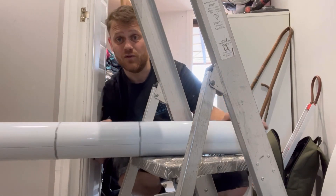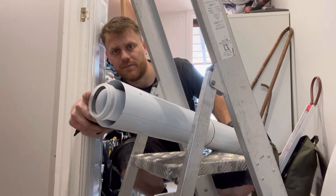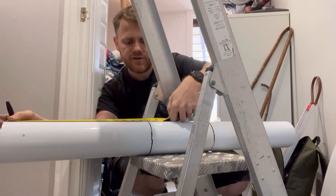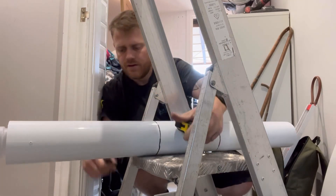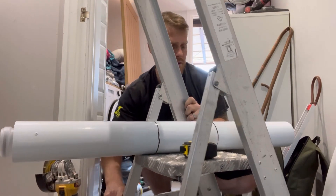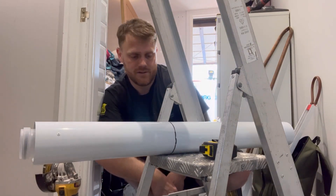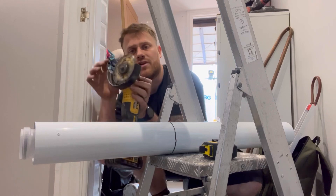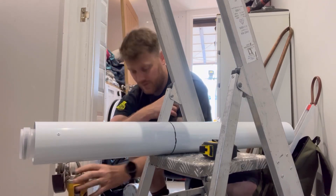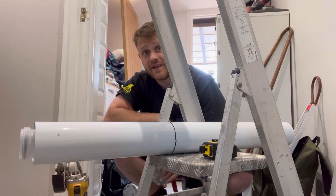I've got two lines so I nearly cut the wrong one again. You want to measure from the end — it's got that lip on. So from there to there it's 317. I've got an angle grinder now — when I was an apprentice all we had was a hacksaw. This saves so much time. That's the DeWalt Extreme metal blade, really good, worth its weight in gold. Paid a little bit more than the normal ones but it rips through it. So let's get this cut.